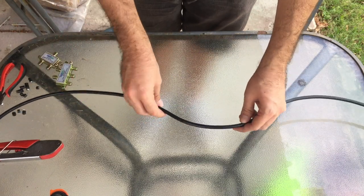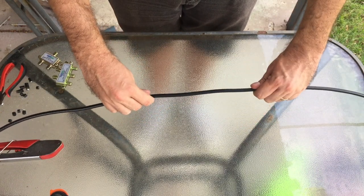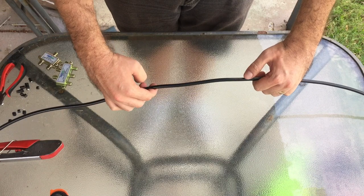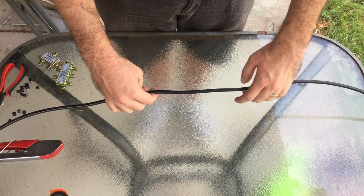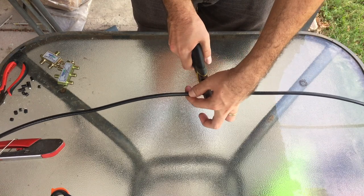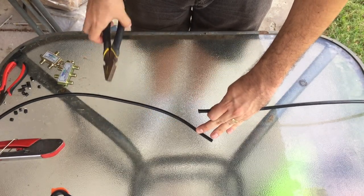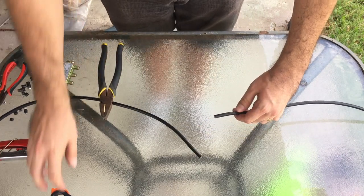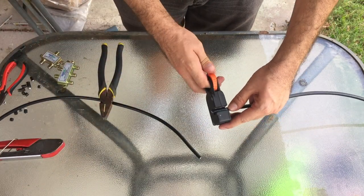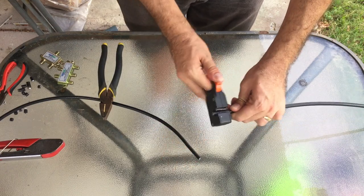You need to make sure that you've got some slack on your cable, as you need to be able to do some terminations. So if your cable is really tight and you can't pull any back, it's probably not a good place to make a split. I'm just going to cut the cable and not lose either end of it — pretty important when you're in a roof, as sometimes the cable almost slips straight down the hole. I'm just going to terminate each end of the cable now.